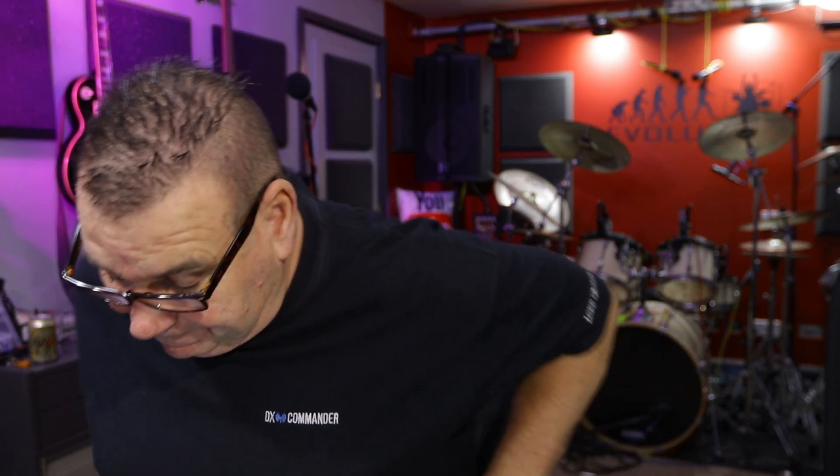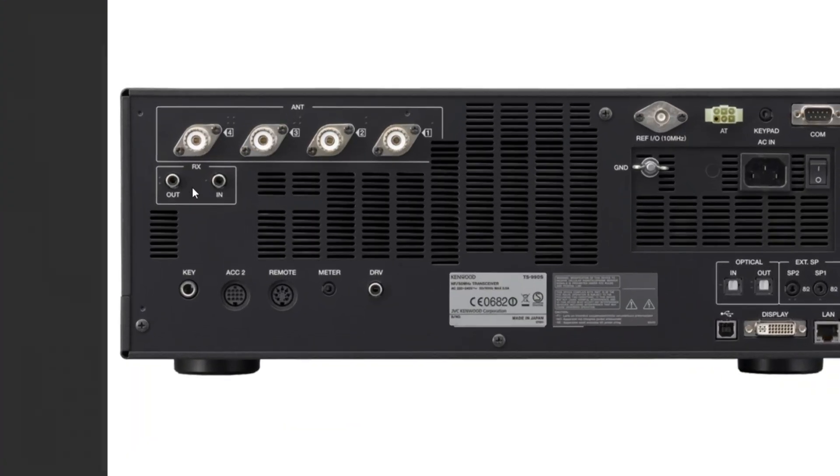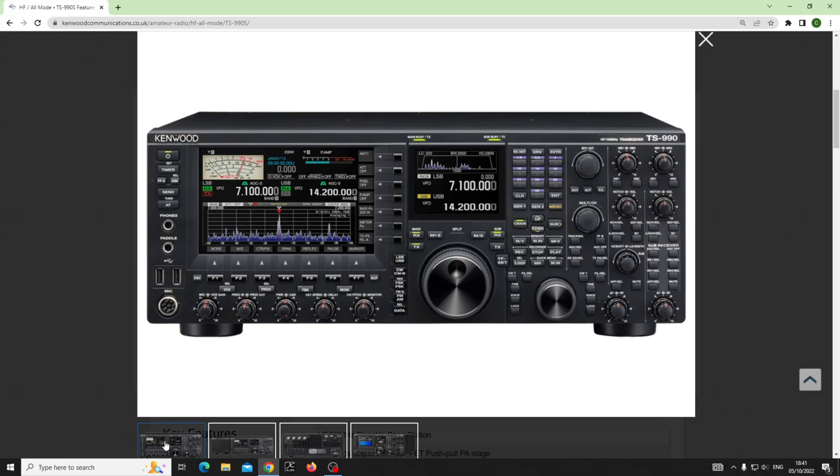So you end up with a marvellous stereo image — people spread all over the place, and you can pick out individual stations. That's two great reasons for a contester to have two VFOs with two different antennas. You could even have an amplifier on each antenna port. On the back of this radio, like most radios, you've got a receive jack — top left, in and out. I've got a bit of coax on a phono lead going into that, and I can select what I want. I can go to the sub-receiver menu, set a different antenna, while my main transmitter stays on the primary port.